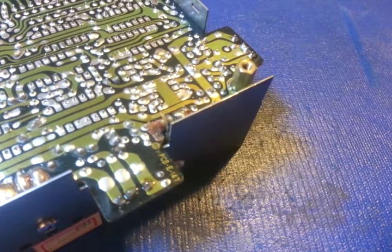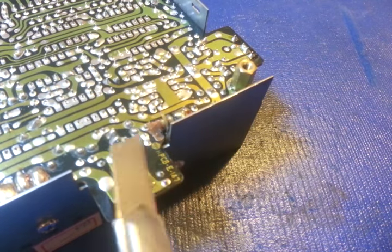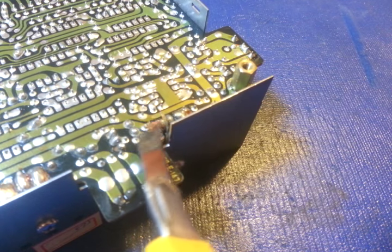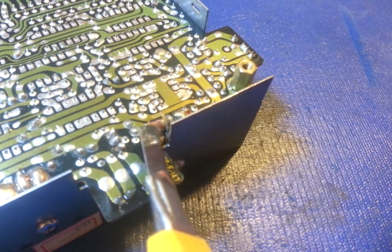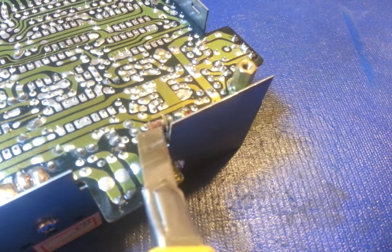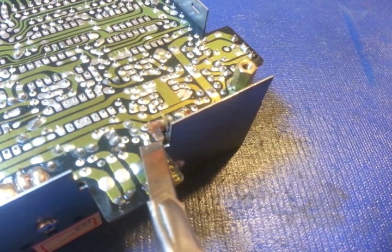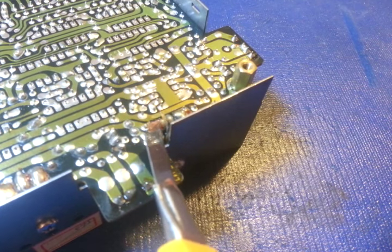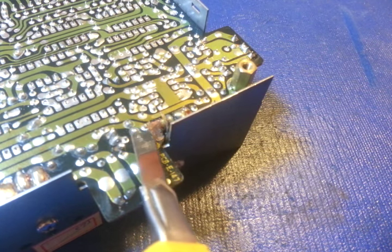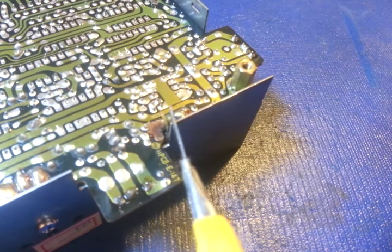So I don't know if it's the copper itself or it's the solder that they used on these boards, but there apparently wasn't good wetting action. My opinion, it either was bad wetting action. The wetting action is the actual, because when you solder something, you're making basically a new metal. You're making a very thin layer, on the atomic or microscopic level, but you are making a new metal, because when you solder, the wetting action is, you have this copper foil on the circuit board, you have your solder, which is now just stuck to the lead,